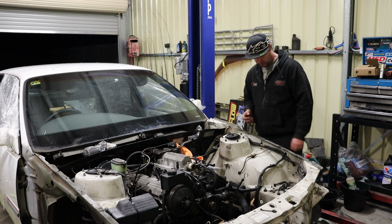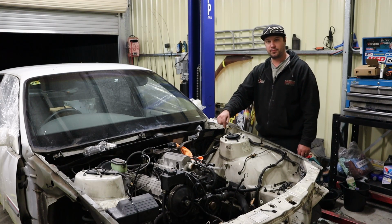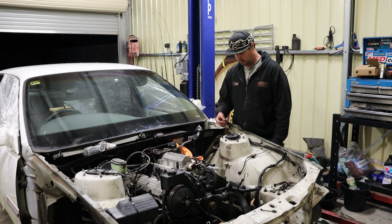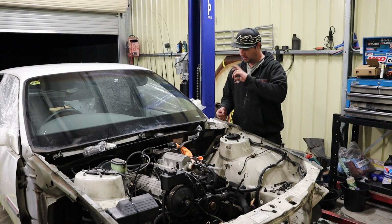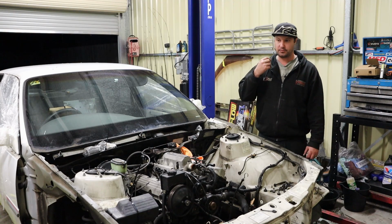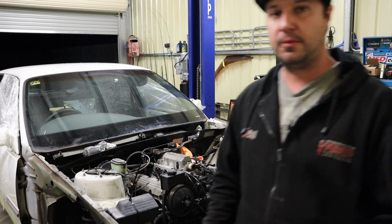I think for now, my first step, I've got a rough idea where this back pipe is going to go. I'll probably start there. I'll trim it on the lathe because I don't need a full 90. Tack it to the flange, tack another 90 to it because I know it's got to run that direction. And I'll measure a piece of pipe, cut and trim it and get it. You guys will see what I'm doing as I'm going.